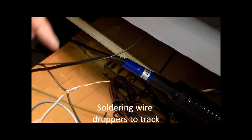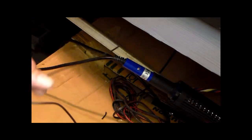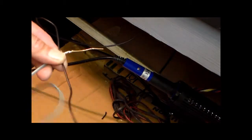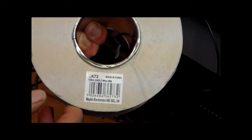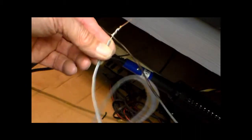This is the next dropper ready to be pushed through the baseboard. Here is the wire that's already attached to the previous connection to the rail. This wire here is still attached to the rail of 24/0.02 cable — it just says 24/0.02. So I'm not going to trim that to length until this is already fixed in place, and then this wire out here I'll stretch along to the next location and trim it to length.